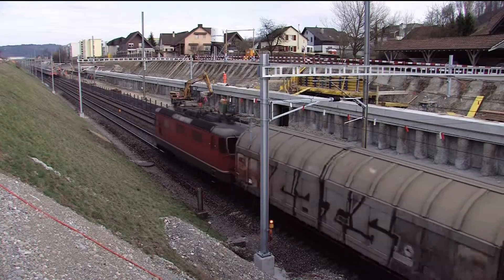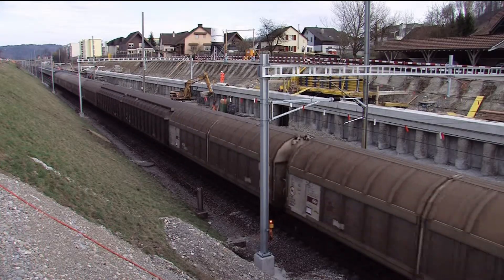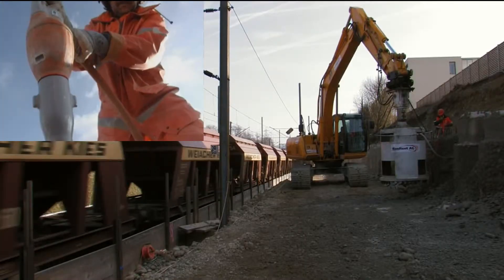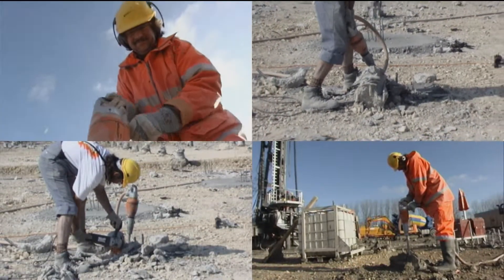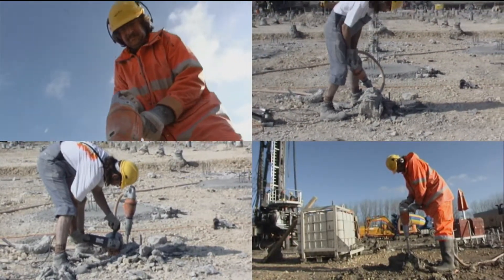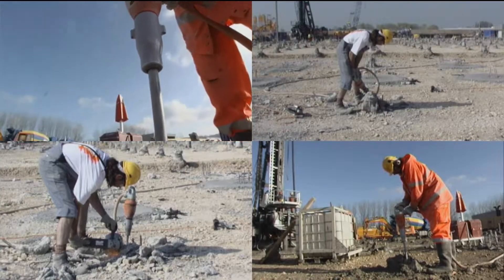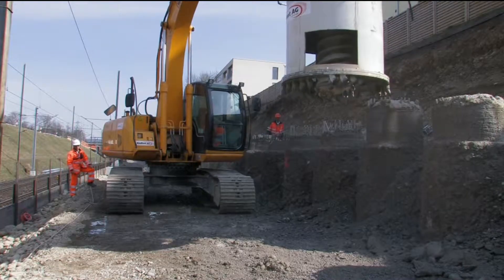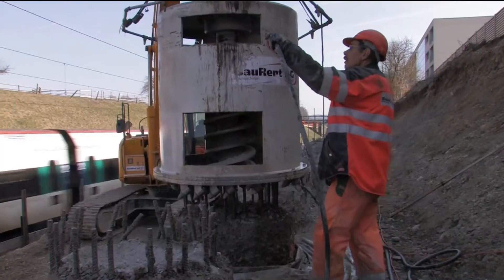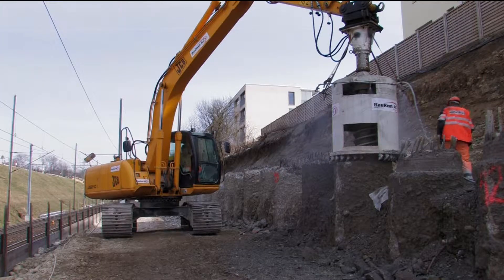Drilled piles, vibrated piles, and impact-driven piles are frequently installed as a foundation for buildings, which are directly connected to the piles and their reinforcement. For this purpose, it is required to chip the excess concrete off the pile heads down to a determined height and to uncover the reinforcement bars. The required work is often carried out manually in order to supply undamaged starter bars to the next contractor, thus it is time-consuming and cost-intensive, not to mention the pollution caused to the environment.